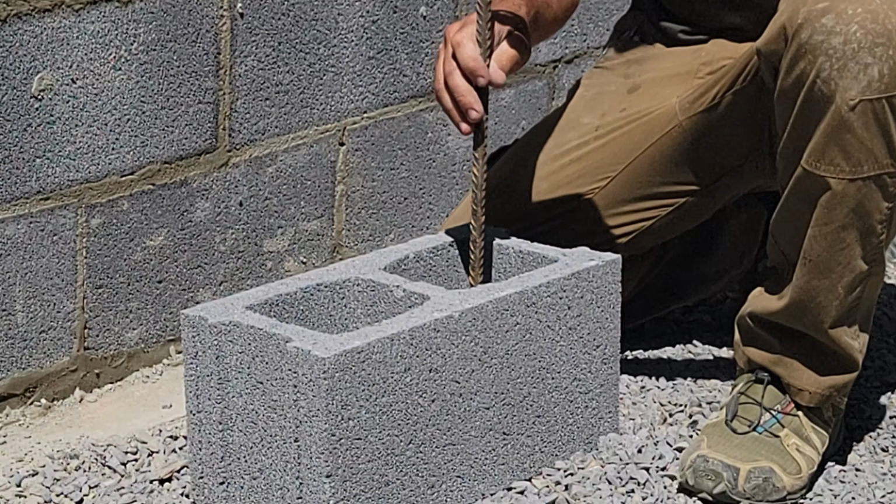So at this point, you can see right here it's going to be 6 feet. This is your top, your center block wall. That's the top right there. So your floor joists are up here. The goal is to have a mechanical space you can stand in. You might be able to walk in a lot of the crawl space. In here, mechanical room, sump basin here, mechanical equipment along here. A sleeve for where the pump will come in, the well water, so the well's over there, gets piped over to here for your treatment. That is where the septic line, the drain line, will go out to the septic tank.